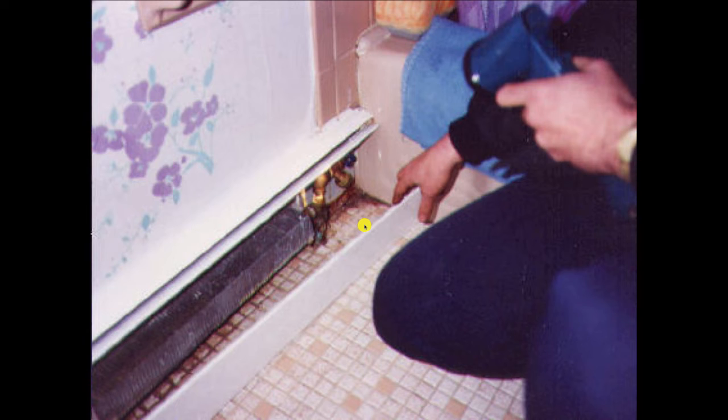So the woman said, "Okay, well, I like to take a bath every night. I'm not a shower person. I love laying in the bath. And would it be okay for me to fill the tub up through that same hose?" And the guy said, "Well, I don't see why not. It all comes from the same place." But he's not considering that it's probably not the best idea to fill a bathtub with water from the wrong side of a boiler, not through the tankless coil side, but from the cast iron side.